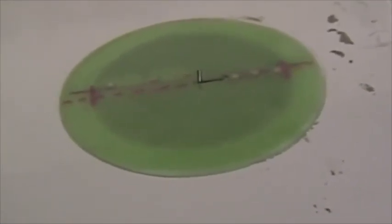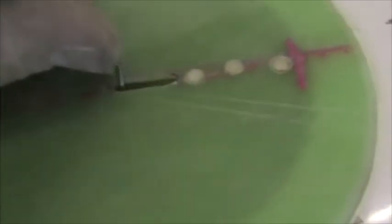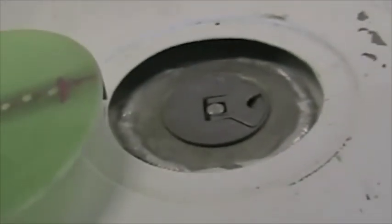Here's the fuel cap cover, which you can fabricate from any scrap piece of glass of about 150 diameter. There are a few cutouts that you make on the aircraft. Keep these and you can use one of these to make this cover. There's the latch mechanism. When you move this wire backwards, it disengages the latch, and then you can pull the plug forwards and remove it.